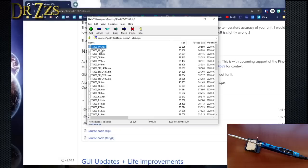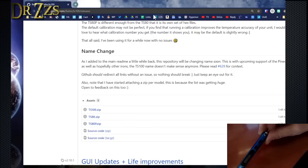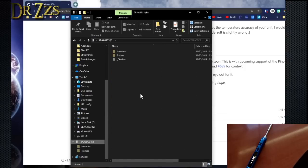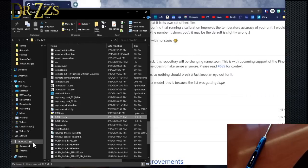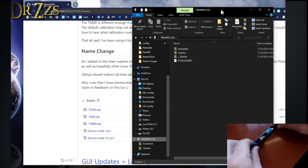You want the hex file for your language. There's a USB port on the back. You plug that into your computer, then hold down the button that is closest to the tip and plug it in. D-F-U — that means it's ready to be programmed, and it should show up as a USB drive. There it is. Now we grab that TS-100 hex file, I'm going to go with the EN. Drop that in there. It went away and now it comes back — there's a ready file in there. So now it should be ready.